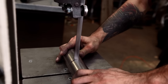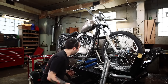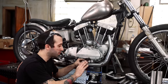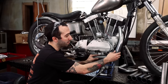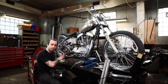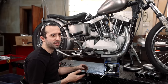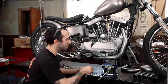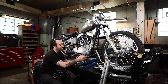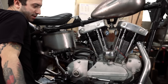I cut the 45 a little bit to raise the pipe up so these two fit together nicely. I got it fit into my clamp where I want it to mount, and instead of having to hold all this stuff while I tack it, pretty much everybody's got one of these flat jacks — if you don't, you should go get one. They're super handy not just for jacking up your bike but for working on it, like making exhaust pipes. You can even level the pipes and have the frame level left to right.